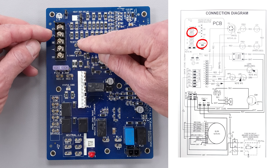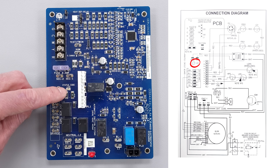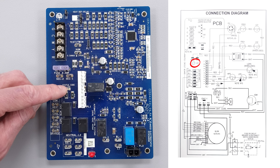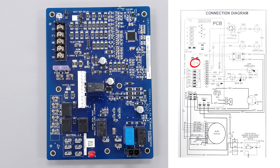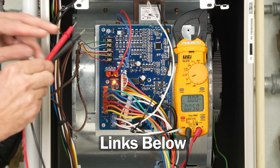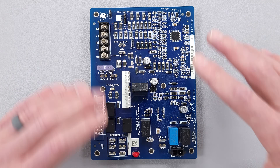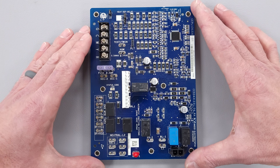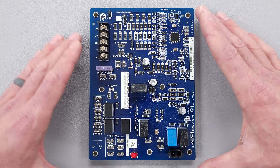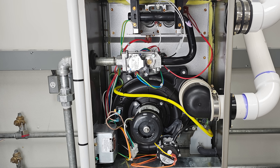Over here between the test pin and the common, you can recall your status error codes. There's a little LED - sometimes you'll see it extended off the board in different colors. You can follow the manufacturer's literature for that, and we have a whole other video on reading status code lights to start your troubleshooting process. The main object for troubleshooting is just to know what this circuit board is really supposed to do in a gas furnace. If you know that, and you know what the components are and what they're supposed to be doing and when they're supposed to be powered, you can effectively troubleshoot these gas furnaces as an HVAC tech out in the field.